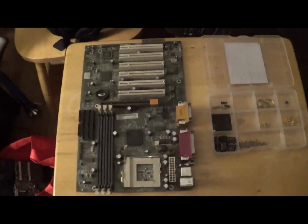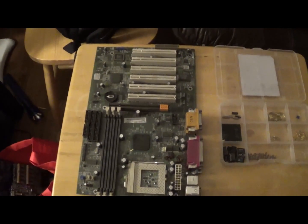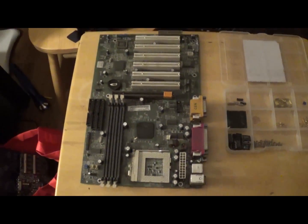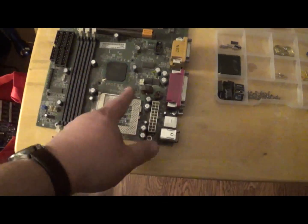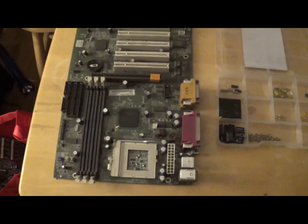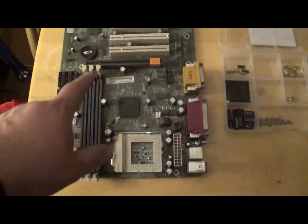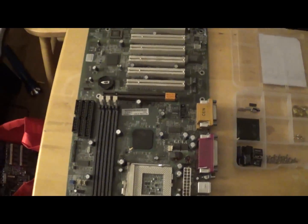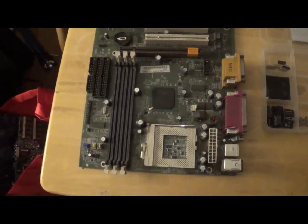All the metals that he pulled off of those — what I've done here is just to give you an example of what we're talking about for material. This is what would be considered one of the higher-end motherboards. It's green to start off with, has the large socket, and it's not a metal socket. This is one of the boards that had one of the ceramic chips, so this is older — it's gonna have thicker plating. Again, it has north and south bridge chips, a lot of ICs, some monolithic ceramic capacitors, et cetera. What I've done is I've taken a board just like this and completely pulled off everything on it that contains gold or precious metals.